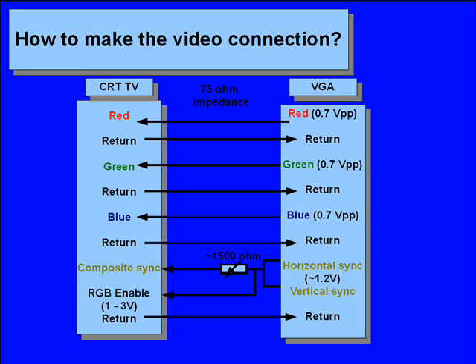How to make the video connection. In order to connect your VGA port to the TV's RGB input you have to connect the corresponding color signals and the synchronization signal so that the connection is complete. The connection for red, green and blue signals is straightforward since the signals are already 0.7 volts peak to peak and no conversion is necessary. The TV expects a composite sync signal, so the horizontal and vertical sync has to be combined. Luckily the TV also expects negative polarity for these signals, so the two wires can be connected without any electronic components.